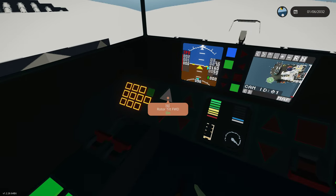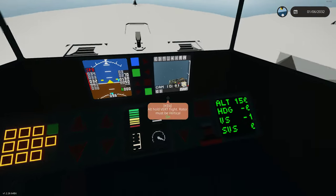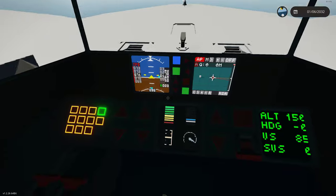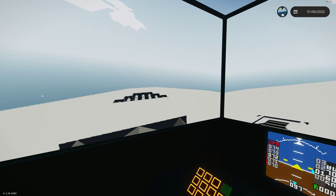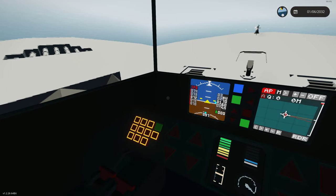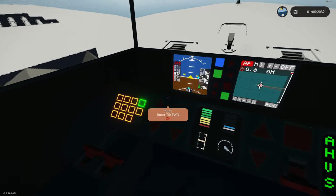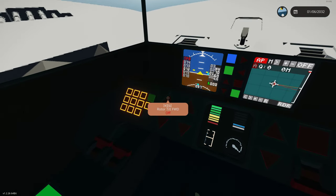We're just going to gently start sending these forward. We're at 25% — as you see the speed's coming up and we're moving away. We'll click the rotors forward some more. So we're just below 50%. Once you go from 50% onward, the props are going to stop controlling the flight. Right now our props change orientation in order to roll us, pitch us, yaw us. Once we start going past 50%, the control surfaces on the vehicle are going to start doing that. We need to make sure we have a high enough speed before we go past 50% — so ideally 100% is good.